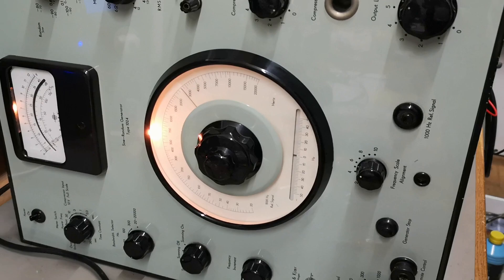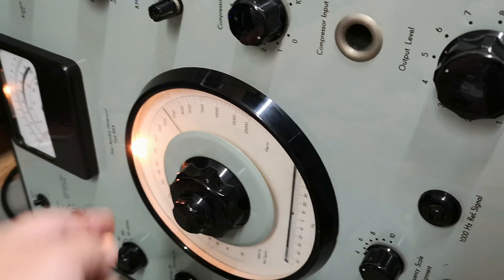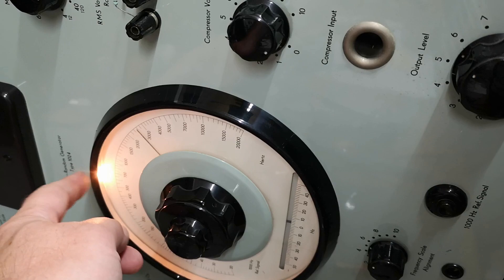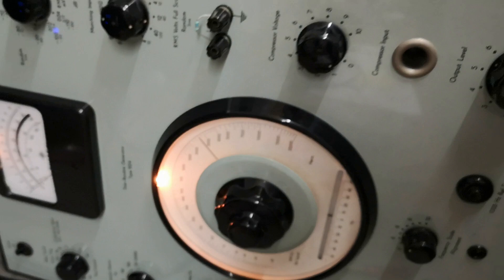Down here it was a little bit annoying brightness-wise, so I added a series diode with the bulb to dim it. I used a 6.3 volt 300 milliamp bulb — the manual specifies half an amp, which would be way too bright. With the diode it's now half that. The top one is a 12 volt 200 milliamp, which is really nice and dim.